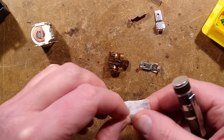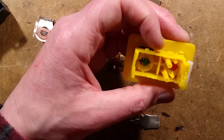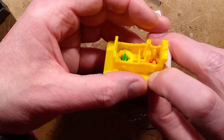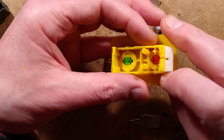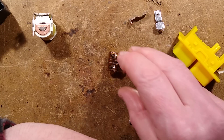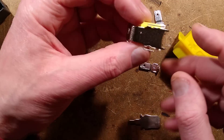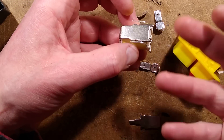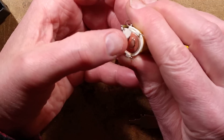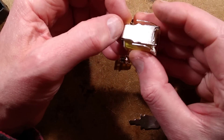Excuse this pack of silica gel - not sure where that came from. But I like the fact that when you push the stop button it isn't just breaking an electrical connection to the coil - it's actually forcing the circuit back open and in doing so breaking the connection to that coil and releasing it. I measured the power consumption of this: it was three watts, or three volt-amps since it is inductive. Not sure how hot that will get in use - I didn't leave it running for too long - but it is designed for fairly long use in a sort of factory environment.